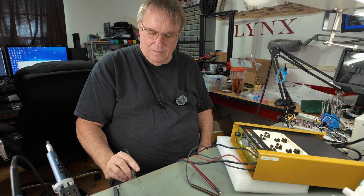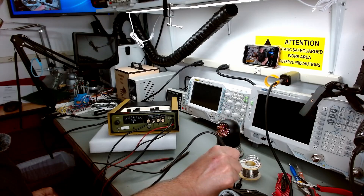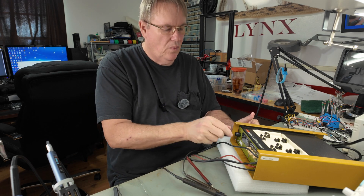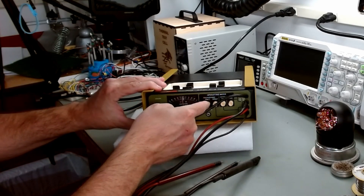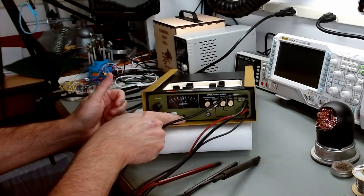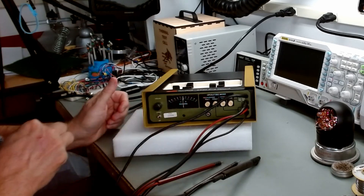Signal trace works the same way — I can trace all the way back to the meter. It works. That's exactly how this piece of equipment works. You've got a volume control here and on/off. There's also a zero adjustment here — like when you put it on the microvolt meter mode, you can zero it right here using a non-conductive screwdriver. Put it in and turn a little here, and as you can see, I'm centering it out right there.